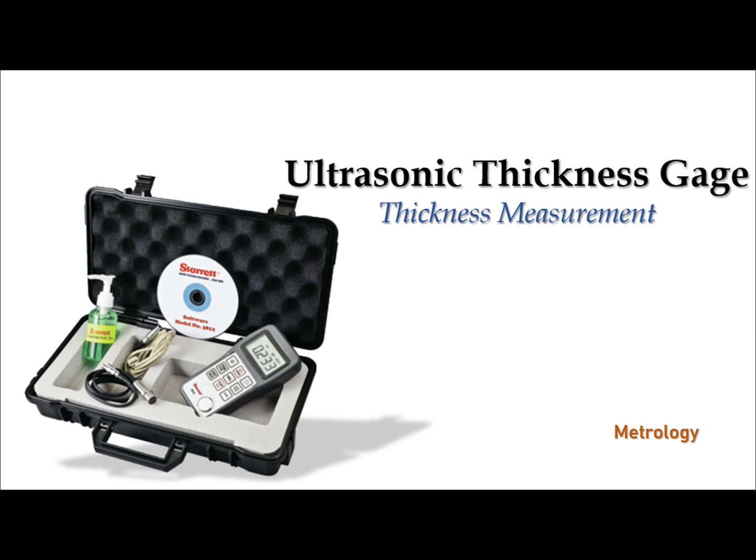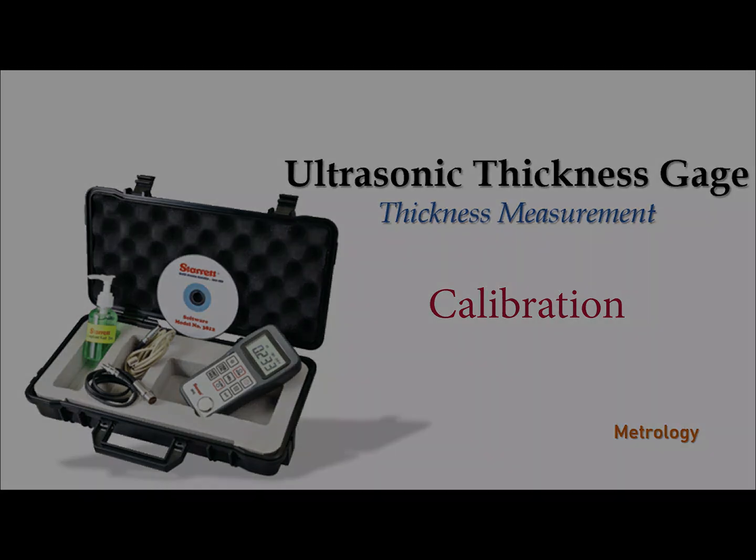Designed to test metallic and non-metallic materials, which have parallel top and bottom surfaces, and sound waves can travel through the material. The technology incorporated utilizes a simple ultrasonic dual element transducer that transmits and receives sound waves. Now let's see how to calibrate the ultrasonic thickness gauge and the way to take the measurement.